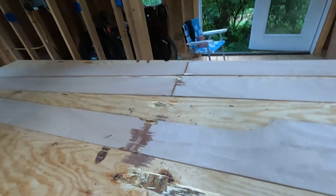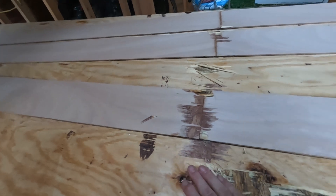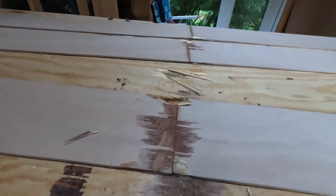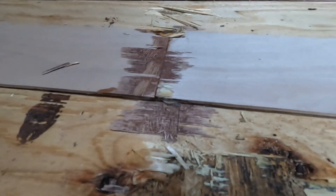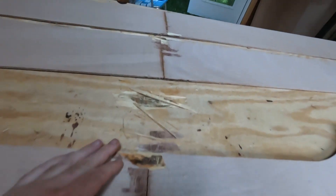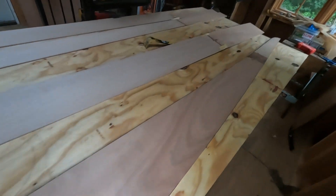I made a big mistake last night when I was epoxying the hull panels together. I forgot to lay down wax paper underneath the underside of the panels, and now they got stuck to the plywood and I have damaged them trying to get them off. Some more than others. These two look okay, but that one might have to get redone. Very frustrating and stupid mistake to make, but that's how it goes sometimes. Live and learn.